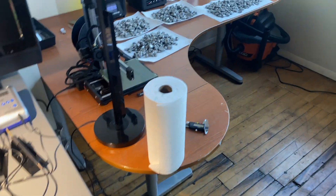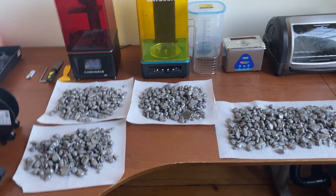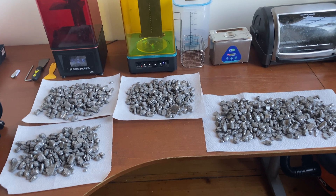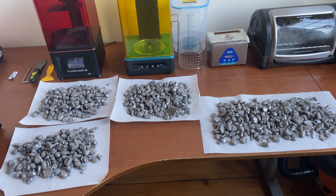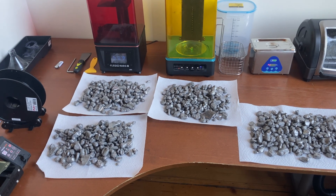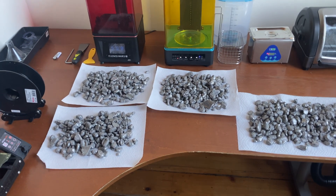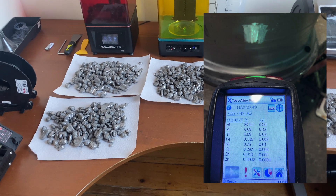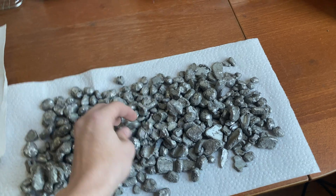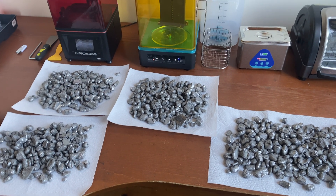This is the aluminum I have acquired. It's aluminum 4032, and it came from a car wheel off of a scrap yard in Chicago. I have an XRF scan of the material, which is great because I know exactly what I'm working with — I can look up the properties and understand what these metals are going to do for me. I plan on making pistons and other parts, which is actually what this alloy is typically used for. I'll put the XRF scan up on screen with some information in the description. The chunks are currently drying after cleaning and are good-sized pieces I can throw in my crucible. Some have paint which I'm a little concerned about, but it should burn off and I plan on having good ventilation.